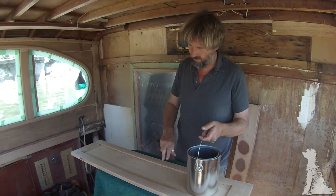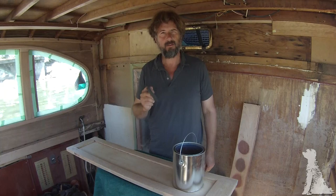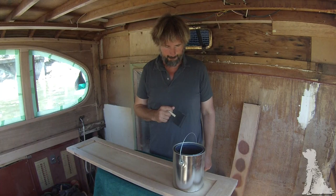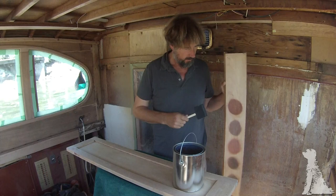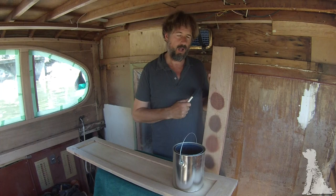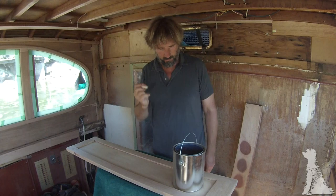Good and Boats. Cheers! First thing I'm going to stain is these forward companionway doors. Probably the reason I'm going to stain them first is because I'm a little nervous that I'm not going to like the color, and it's a little easier to sand these entire doors again than the cabin sides. I've modified the color tint one more time — four parts Sedona Red and one part Red Mahogany. These are all Minwax stains. I know that's not a marine stain, but I've used it for a long time and it's always served me well. And this is effectively interior, and it's available five minutes from here.